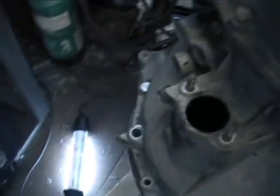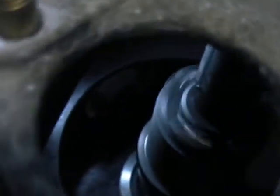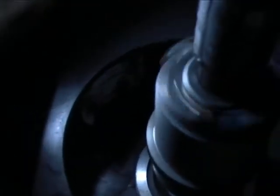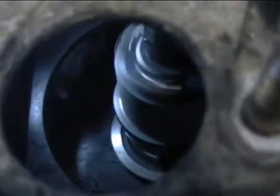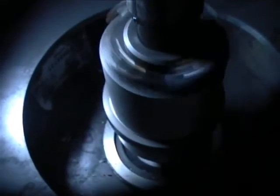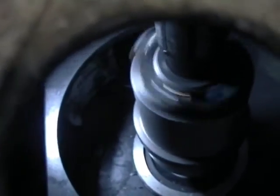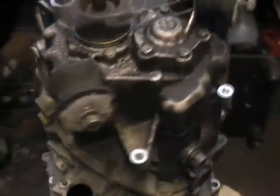You can see there's no play, no vibration. The gearbox doesn't sound like it's got a problem — in fact it sounds better than it did when I had the jaw coupler on it. I'll get the inspection lamp into the other hole there and actually get a look in there with that coupler spinning around. There's no play at all in that drive, it's a hundred percent happy. There's no oil in it even at this stage, but it's no harm to run it briefly at low speed like this.